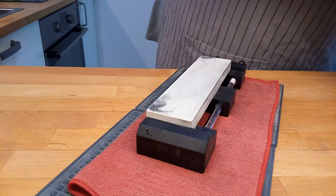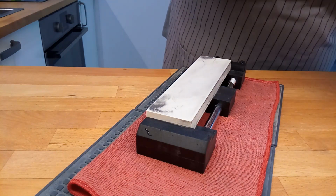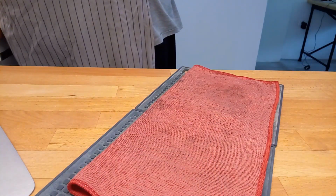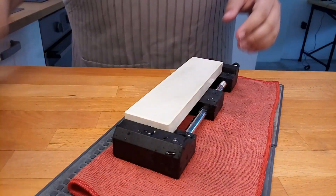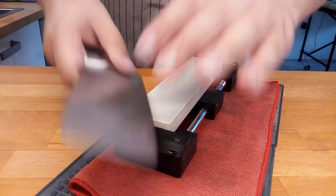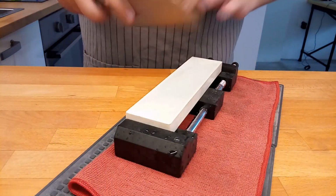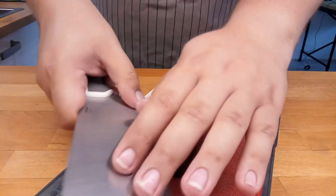By conditioning the stone on 220 grit silicon carbide on glass, and being such a hard stone, I can alter, just to rinse it off, I can alter the speed of the stone. As I said, it cuts a little bit faster than it's supposed to. A few cleaning passes. The reflection of white from the apex is almost gone. It's barely visible.